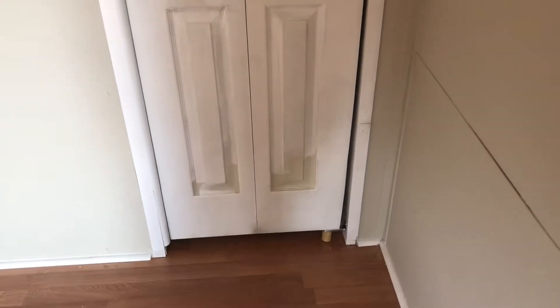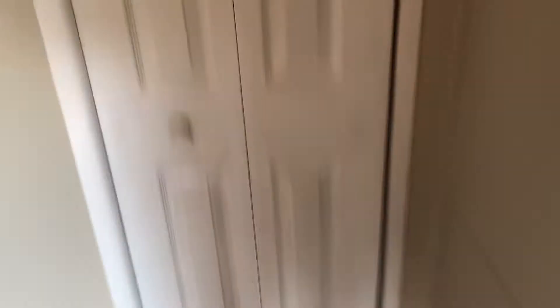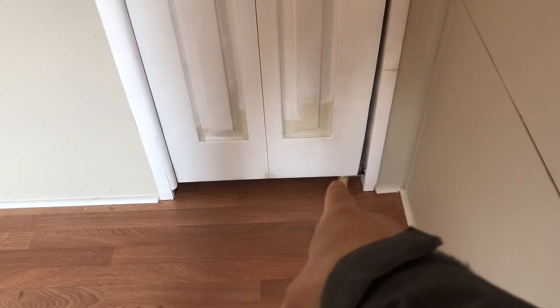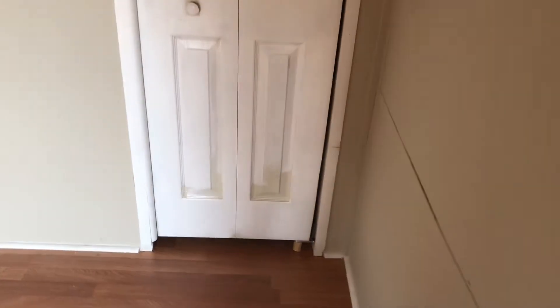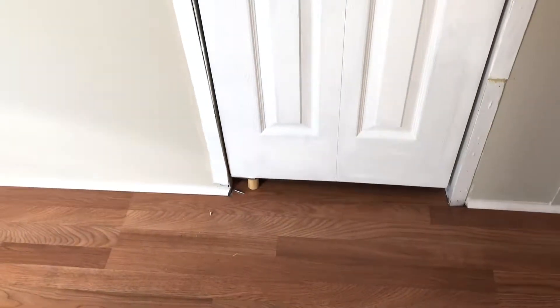Apparently whatever they framed for the doors of the trailers was bigger than a regular bifold, so we've got this little gap down here at the bottom. What would have been better — actually, we should probably redo this. We should take and put a slat up top and drop the door down so that we don't have this gap at the bottom. This is going to be something that breaks — it's just not good to do it that way. Somebody's going to lean against it, and you can see it flexing down there. I would like for it to have been dropped and then fill in the header with a filler piece if needed. I believe the same issue exists in this room as well.